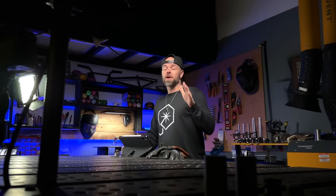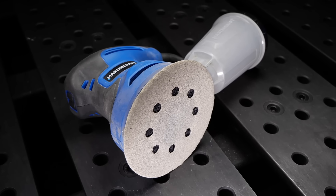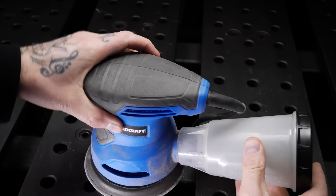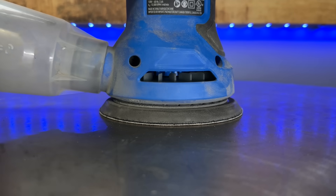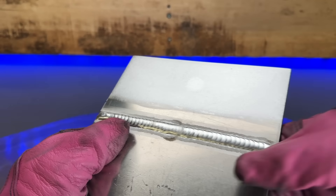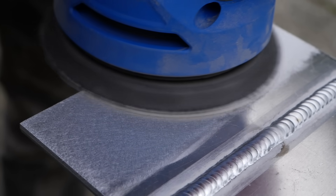The amount of reinforcement we used earlier was perfect. However, you may notice at this point that we can't see our grain direction anymore. So here's what we're going to do to start making it look like all of this work has not been done at all. I'm going to switch to an orbital sanding disc, typically starting with 80 grit, holding it absolutely flat. I'm going to hit the surface of the welded area and the surrounding area, making sure the sanding is spread out uniformly instead of staying in one concentrated area. Don't use the edge of the pad — keep it flat. Once everything has a uniform finish, I'm going to switch to something like 200 grit, and I can even go finer than that.